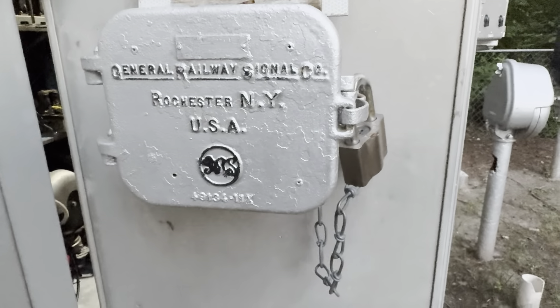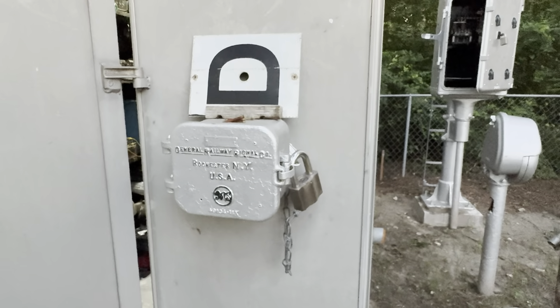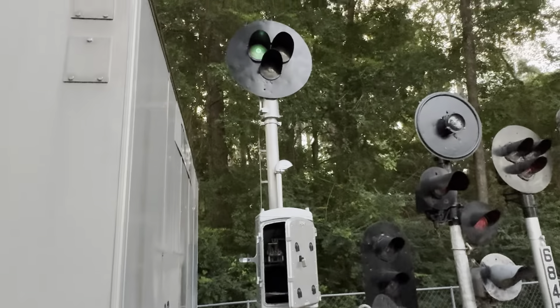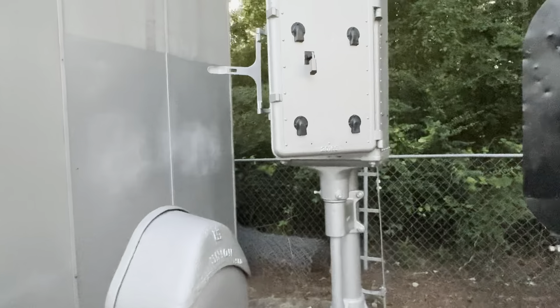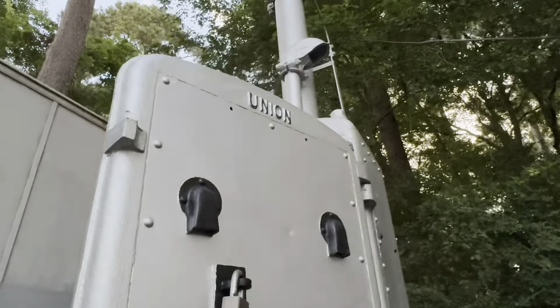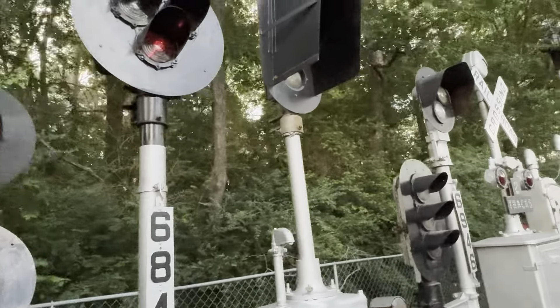This controls the northbound and southbound movements. Normally there would be one box with four buttons for all directions, but I only have one so I put one on the bungalow. The TP-5 just cleared. The light-out relay is picked up — wired in series with the green lamp — and the home relay is picked up, which switches between red and green: picked up is green, dropped is red. It's fail-safe.